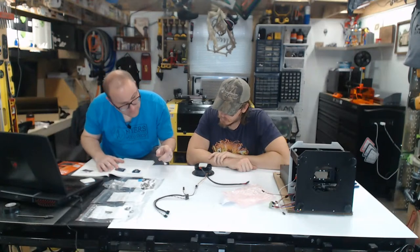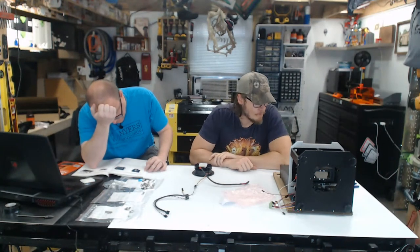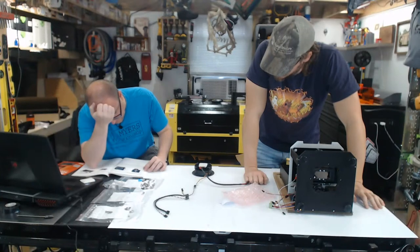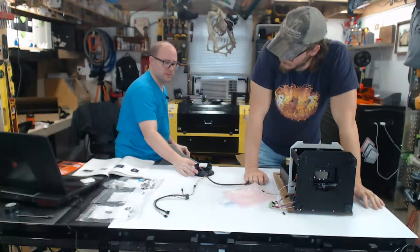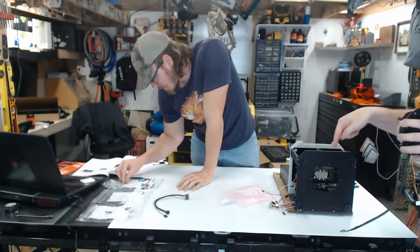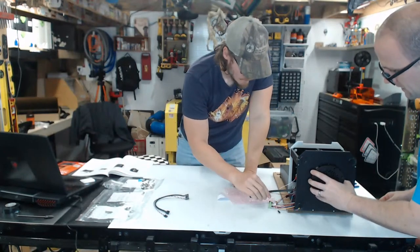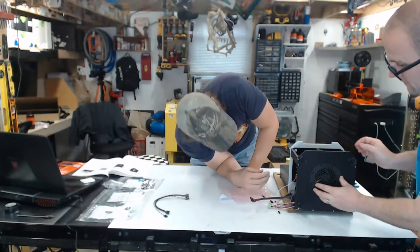Okay, now we're going to put it in the bottom. Lay the printer on its side. Before you insert the UV LED, insert both cables and align them to the back. Slide the assembly up slightly. Secure it with M3x5 countersink screws. Those are all the black ones. So we want the cables toward the back, and my back is laying down. But we want to pop them out to the side still. And this thing is just going to line up like that, right into the reflector, basically.